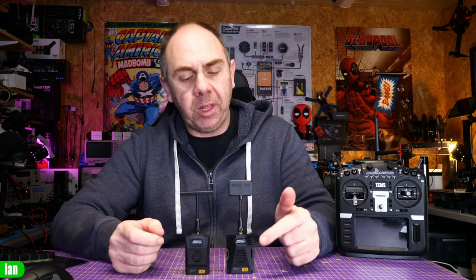To explain in more detail: these modules supply up to one watt of RF power and they have an XT30 power input that you can use to help preserve the battery life on your radio when using it at higher output levels. The issue is that there is no protection between that XT30 input and the voltage input from the JR bay on the back. As a result, if you were to use these modules with an external battery on that XT30 connector, it could pass that voltage to your radio and cause damage.